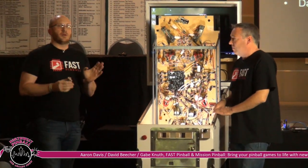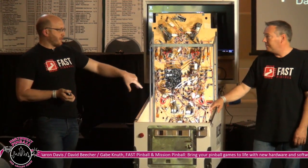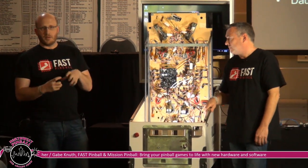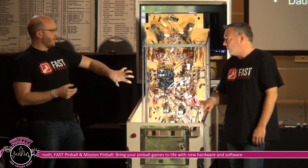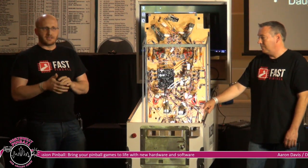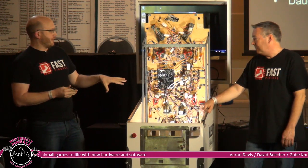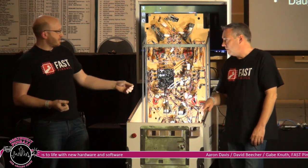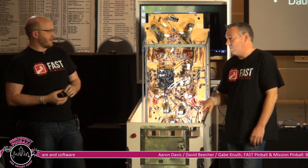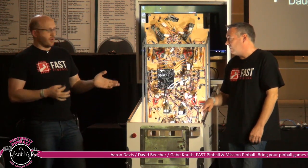People didn't want to be told what OS or language they had to write in. Right out of the gate, we have a BeagleBone Black interface — not because it's the only way, but because it was a nice stable set of footings. It has three separate serial connections right in it, passes power, and has reset lines so when you shut the game off it can signal the OS to shut down. If you're connecting from a Raspberry Pi or something else, you can do a USB connection and it shows up as basically a three-port hub.